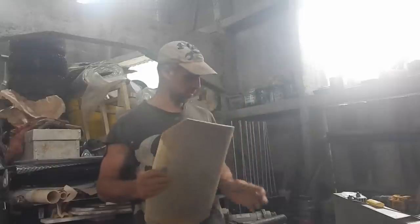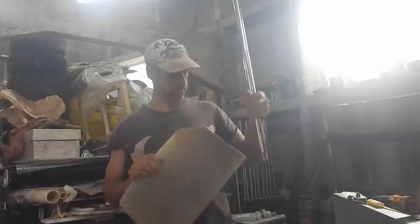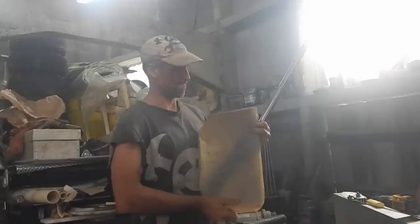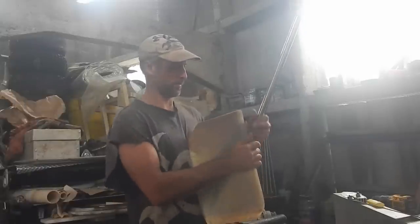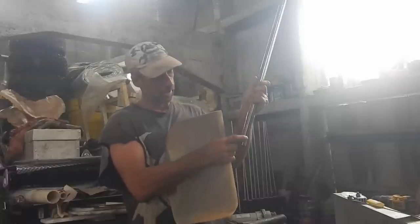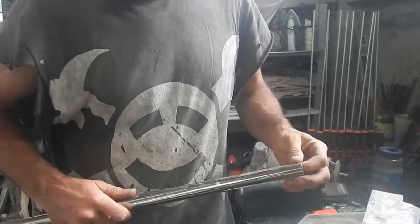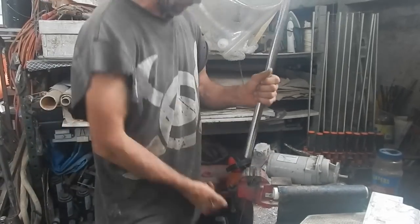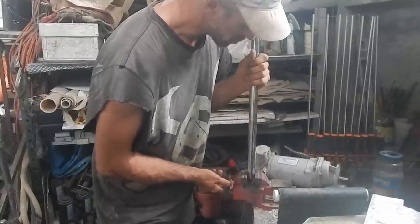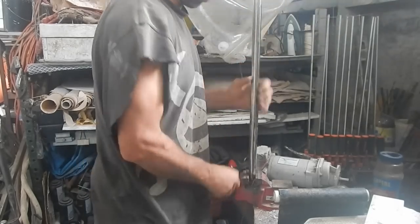That's not perfect but pretty good. If I cut a couple of grooves in here and on the other side, and cut a slice down the middle, I can fit it right on there and then flatten out these ends. I got a cut down there with my angle grinder. Now I want to flatten this end — maybe I can use the vise. Let's see if the vise is strong enough. Oh, it looks like it's doing the job.